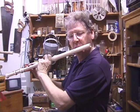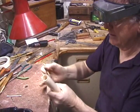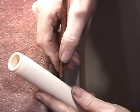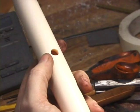Now we've got the ivory head joint playing, trying to model the results that I'd found satisfactory in the wooden head joint. In the final work on the voicing, this triangular scraper, blunt-edged but crisp-edged, but blunt-angled, so that it doesn't dig in, but it will cut sweetly. Sometimes a little bit of work with a needle file helps.